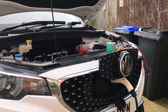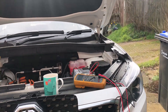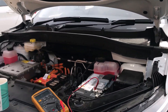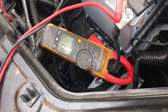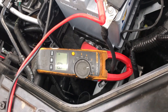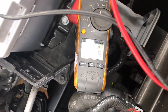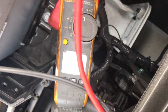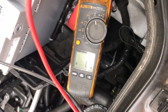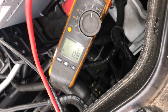We've come outside and moved the car back. We've put a clamp meter around the ground cable going to the battery. At the moment it's reading 0.8 amps — not easy to get on camera, but there we go, we can just see it there: 0.8 to 0.9 amps.